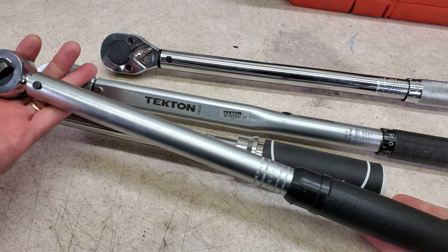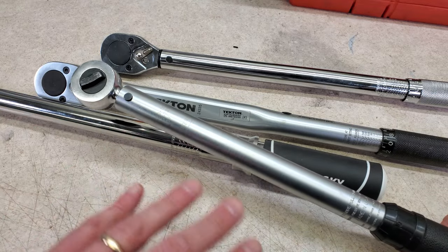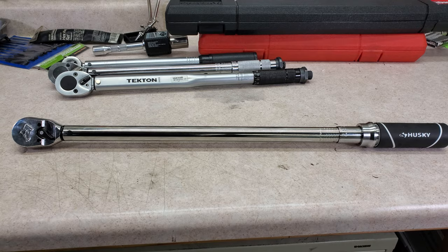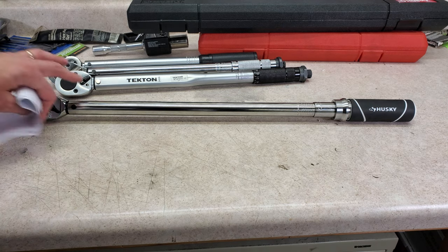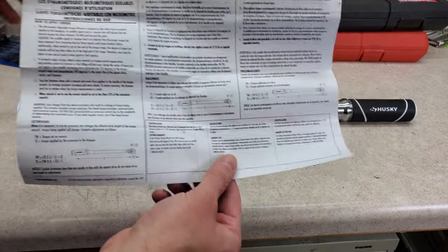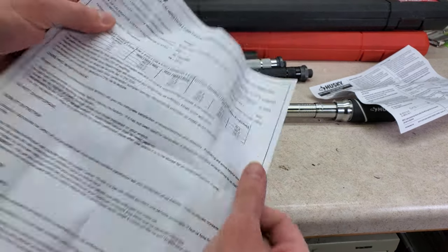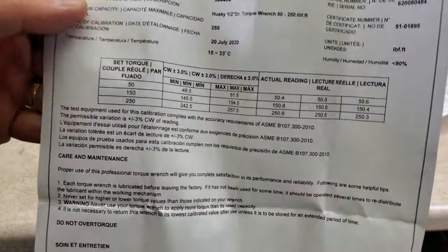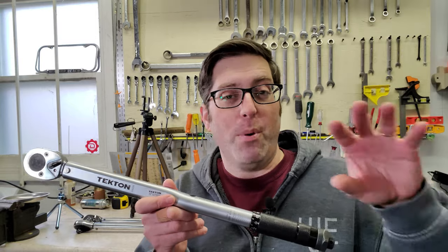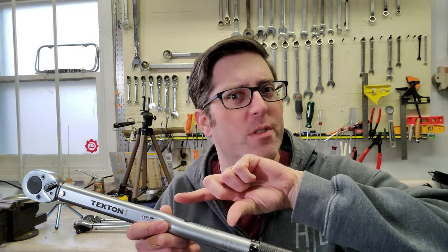Here's one of my 3/8-inch drive torque wrenches. If you're a serious DIYer, you're going to need more than one torque wrench to get all the different ranges you might need. There is also a 150 foot-pound version of this torque wrench, if that's what you want. When you buy the Husky, you get the torque wrench, a pretty simple one-page user's manual, and a calibration sheet showing it was calibrated at the factory at different test settings. One of the most important ways to keep this clicker-type torque wrench accurate is to store it at the lowest setting, which I always do — that helps keep the internal spring from losing its tension.